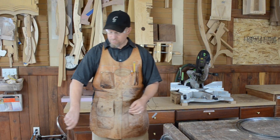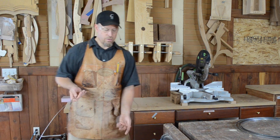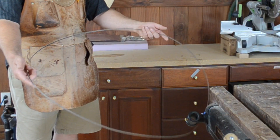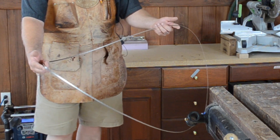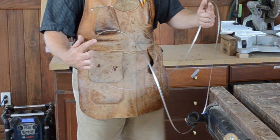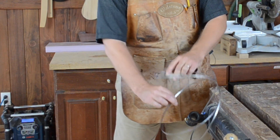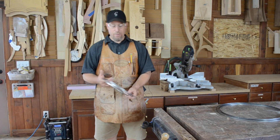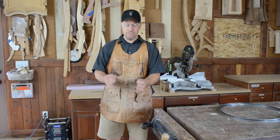It doesn't matter what size blade. It doesn't matter how many teeth. If I hold it a third of the way down and slowly walk into that, it'll fold automatically. That's a lot better than trying to step on it and maybe slice your leg.